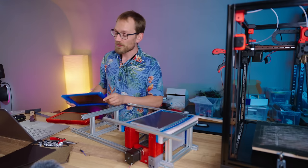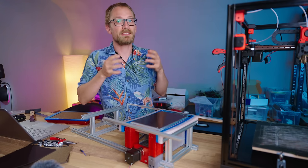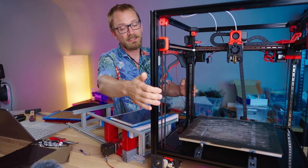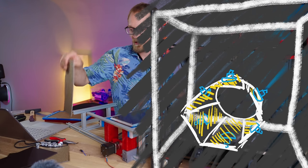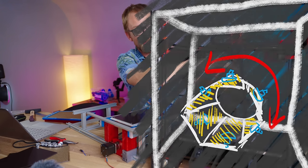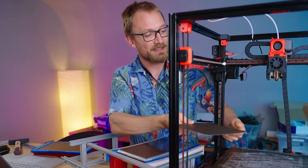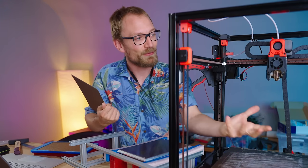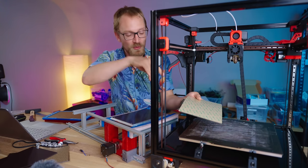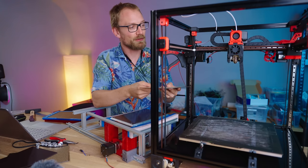So that is the idea behind that. Now, this is a mechanism that is not particularly simple, but it is what I eventually settled on. I had a couple other ideas first. The original idea was why I built this Voron 2.4 in the first place — to have a spinning drum within its envelope that basically had six sides with a heated bed on each side. It would print on the top one, rotate by 60 degrees, and have another bed on that other side. But what I realized is these beds would need to be tiny if we actually have a full drum that fits in here, and especially once we have prints on it, they would need space at the bottom once this thing has done a 180-degree revolution. So I threw that out — it would have been really cool, it would have looked spectacular, but it would have been absolutely impractical.